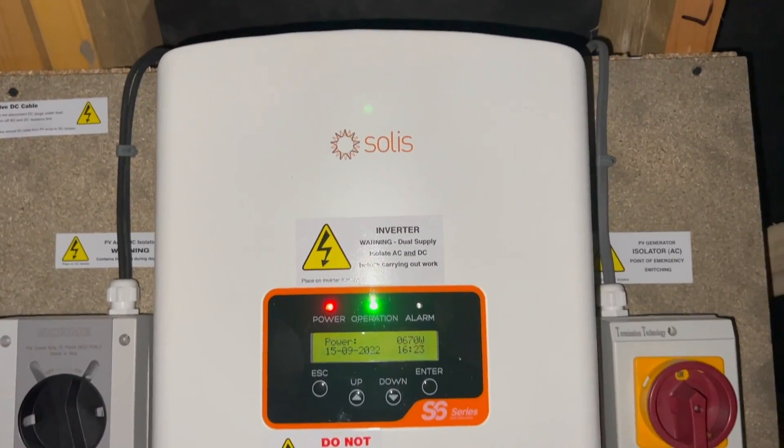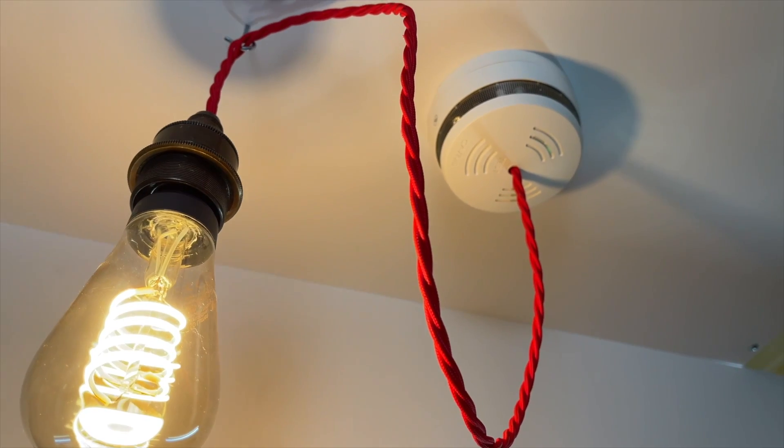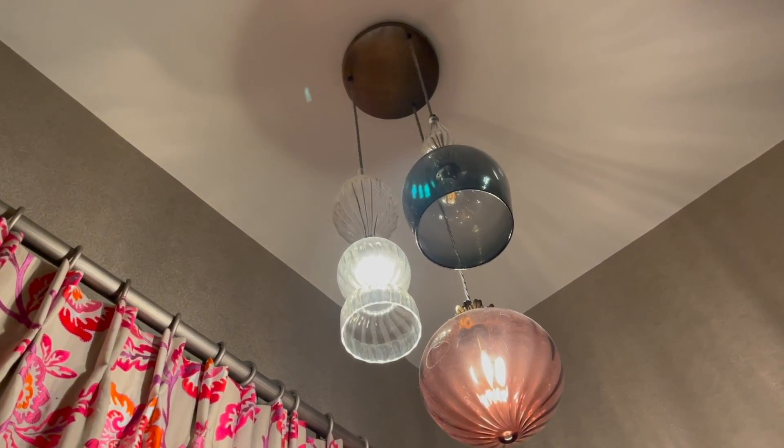You might need to add sensors for extra safety, cover an extension where wiring is difficult to run, or — increasingly common — fit a smoke detector in a loft space containing solar inverters or batteries, linked back to the main house alarm. Now, about that light fitting option we've been teasing: the test button in the middle can actually be drilled out and a cable threaded through it. Inside the detector is a cable grip and that L2 terminal, which connects to a switched supply. It's a great minimal design option, particularly where regulations require the light fitting to be 300mm away from the sensor, allowing for a pendant drop.